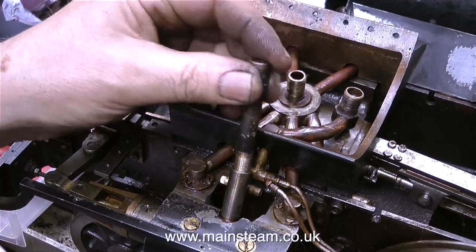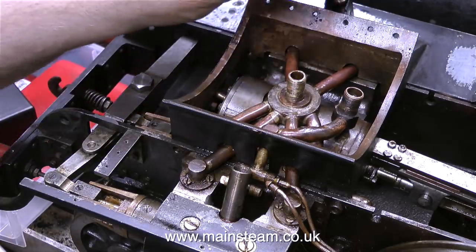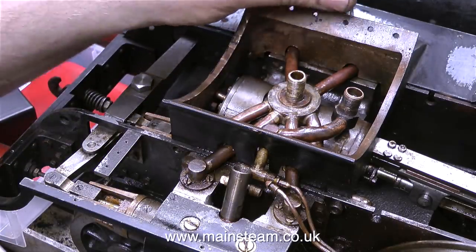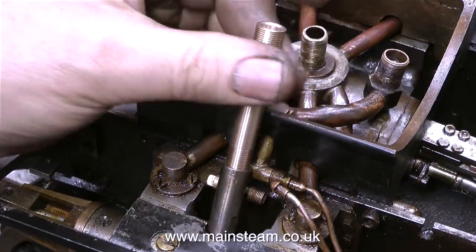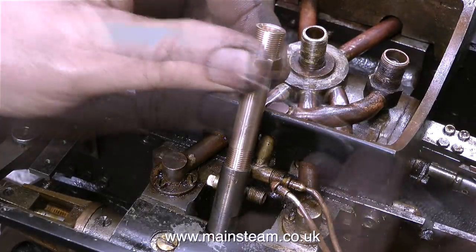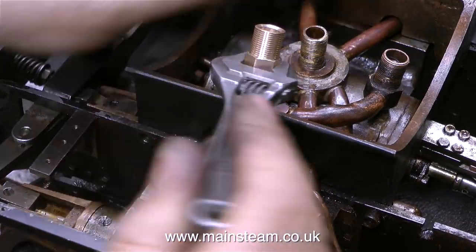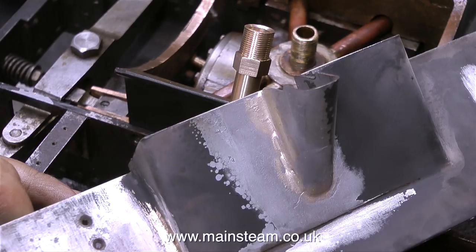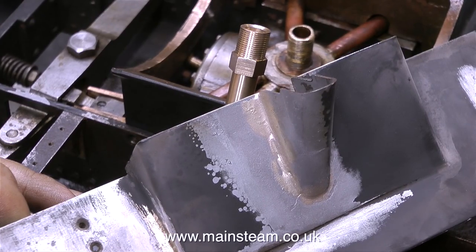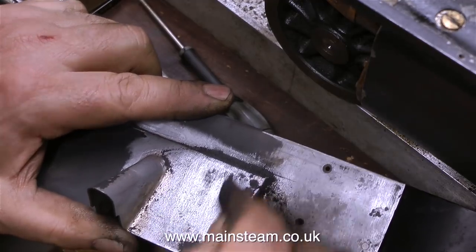To test that the fitting is okay, I removed the pipe from the other cylinder and screwed it into this one. It seems to fit okay, but this pipe belongs to the other side, so I'm going to put it back from whence it came, and I need to make a new bit for this side at the front. And here is the new bit — this is made out of a piece of phosphor bronze, which originally started out life as half an inch in diameter. John, who works at the steam workshop, expertly machined the hexagon part using an indexing attachment mounted on the table of the milling machine. John also fixed this bit — he used oxyacetylene to silver solder this part back in position, which removed more of the paint, which is a good thing, because the paint is not in particularly good condition.